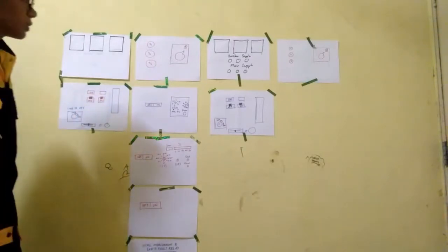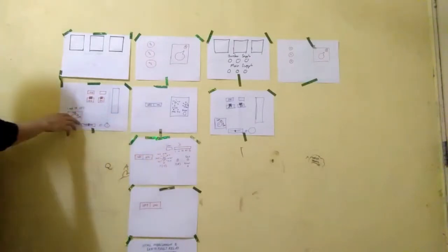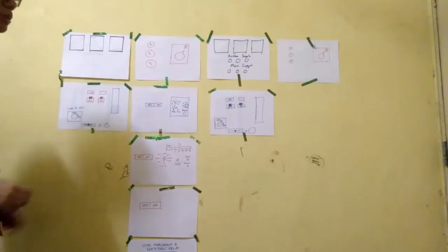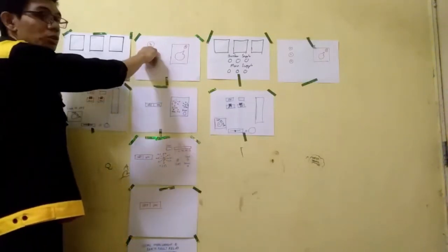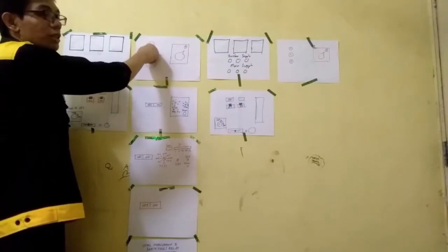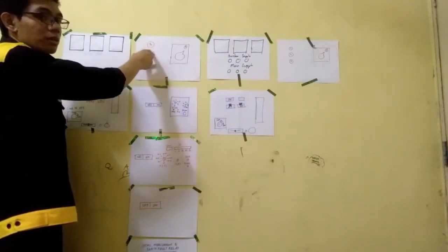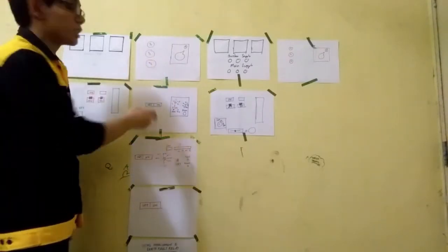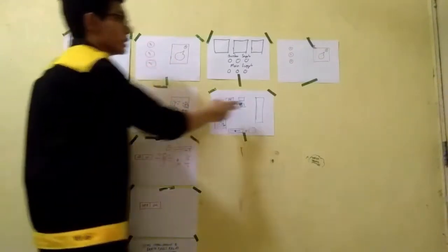Next, you can see there is a keyhole, and we can take the key from the air circuit breaker. This is the air circuit breaker key. We take it and put it at keyhole number 2, which is labeled C2. After that, we can take out key number 1 and key number 3 and put them on the isolators on MSB1 and MSB2.